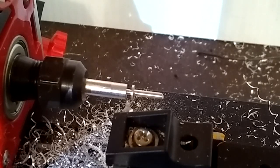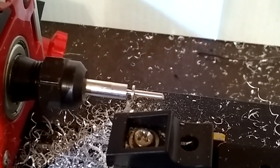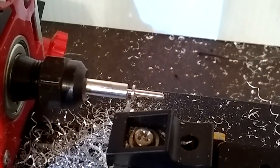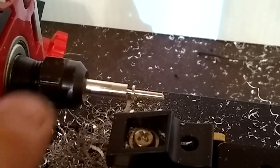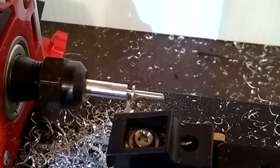So let's continue on. Now, the magnet diameter on the bolt probe is, I believe, 109 thousandths. Let me see here, it's a 7/64 drill bit, I think. 109, yes, a 7/64 drill bit. So we've got to make this between, let's try to make it 111. This is back here. So let's try to do that and we'll go from there.